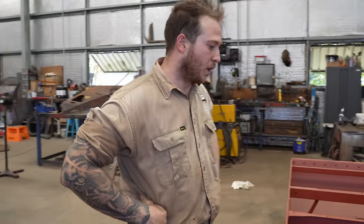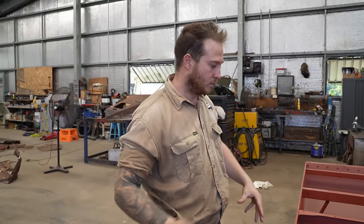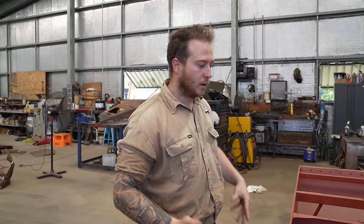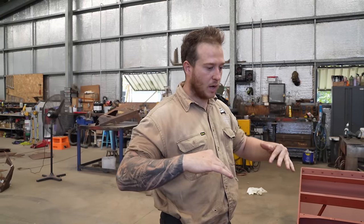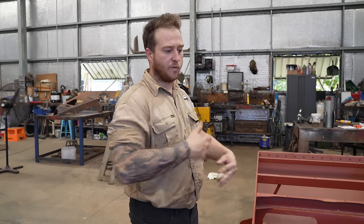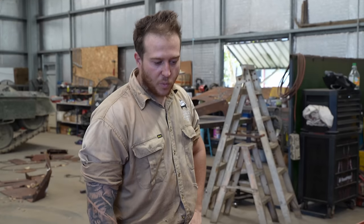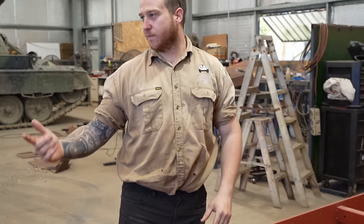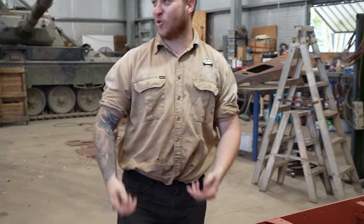What we had to do was start with the hull. So we sourced all the pieces, put them all together, worked out if they were bent or anything, straightened them all out, and then started with the hull on the floor - put the sides up, the front and the back on, put the floor on last, fully welded it once it was all together and then we flipped it. We had some plans and schematics. All the projects we've done previous were quite heavy, but this one you can almost pick everything up by hand.